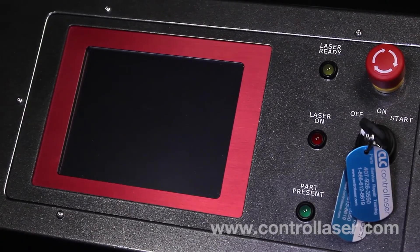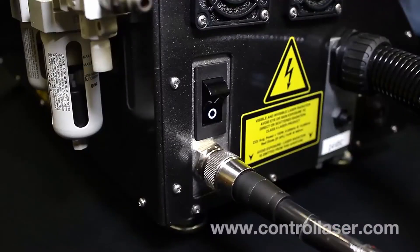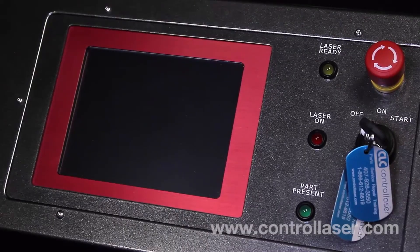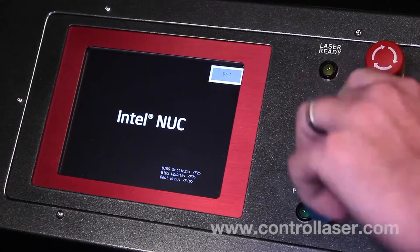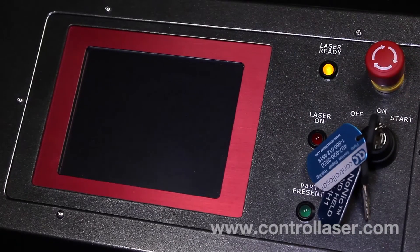You do that by depressing — or verifying it's not depressed — the e-stop. Clicking the switch on the left-hand side, and then moving the key to the start position, and then releasing it. This will start the power-on sequence for your NONIC handheld.